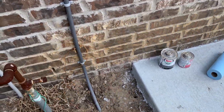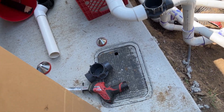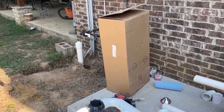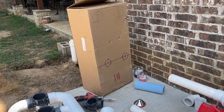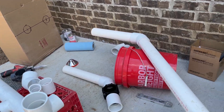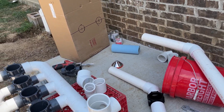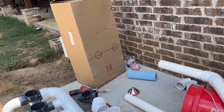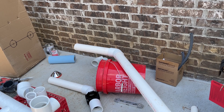Future plans include a heater, but they're expensive so I'm not buying one now. I mocked out a cardboard box with the dimensions of the Hayward propane heater I plan on getting. When running the pipes, I'm doing a loop — the pipe goes out, makes two 90s and a 180 back — so when I'm ready to add the heater I just cut the ends and hook it up. Running the pipes a little long means I can cut back and make adding the heater much easier down the road.